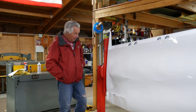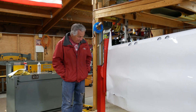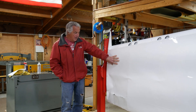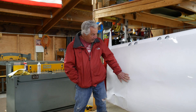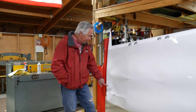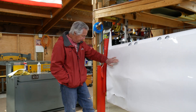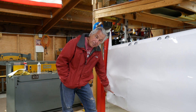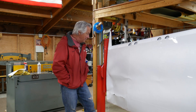Here we are with the result of running out of runway. A little bit of damage on the wingtip. I'm going to take the skin off — you can see there's a little wrinkle right here. I don't know if I'm going to have to take the skin all the way off and repair this or if I'm going to be able to rub that out. New leading edge obviously, in the top skin and the bottom skin, and we're going to have to repair the stringers and repair that fork out there on the end of the spar. So let the fun begin.